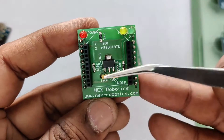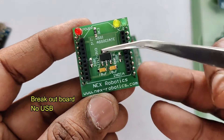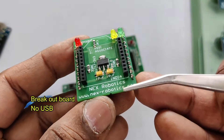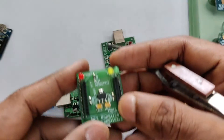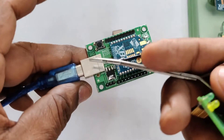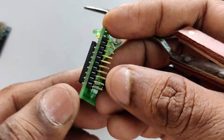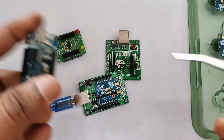The third option is a board without USB — this is best for sensor nodes. First you configure the XBees using a USB board, then plug it onto this simple breakout board which acts as a sensor node. Sensors can be easily connected to this and used individually. This board lacks a USB port but has a 3.3 volt regulator and power and associate LEDs onboard.